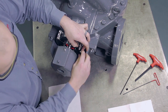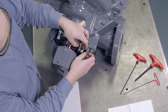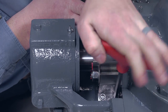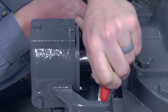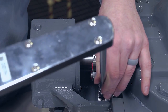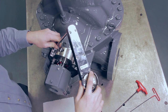Finger tighten the gland mounting nuts so the gland is supported at the pump mounting surface. Firmly press the gland up against the seal drive and towards the seal chamber while fully tightening the gland cap screws. Refer to the installation instructions provided with the seal for the proper torque settings. This action will align the stator faces with the rotor faces, thereby assuring there is no step in the stator face joints.